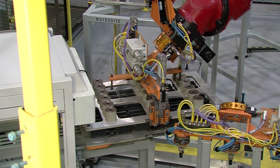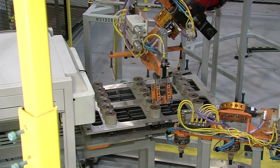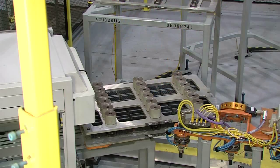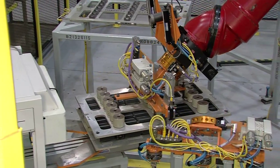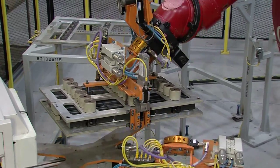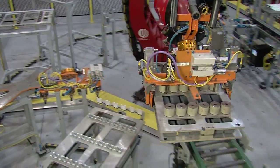To ensure the correct pressure is being applied to the heat sink for the proper thermal adhesive distribution, a weight pallet is applied to the top of the tray. The tray of heat sinks and photovoltaic chips, together with the weight pallet, are transported to a pull-off conveyor and moved into an oven to cure the thermal adhesive.